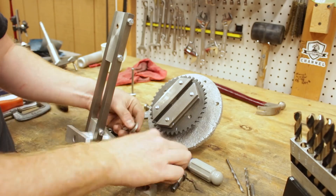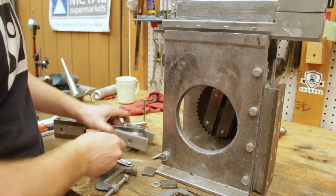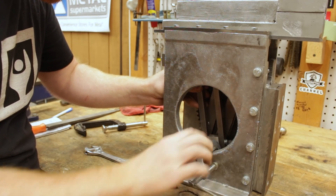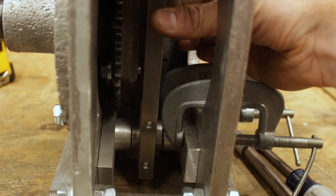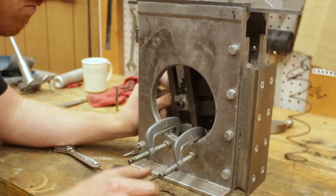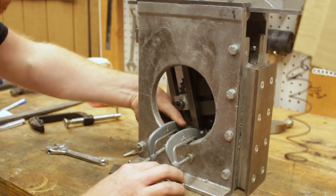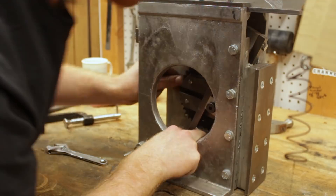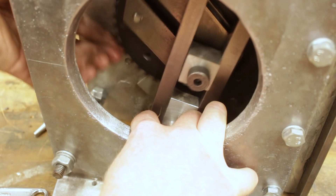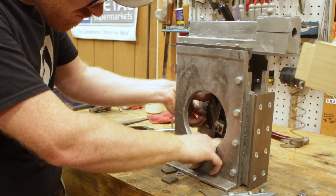The book describes a kind of iterative approach to positioning the yoke inside the column. Basically I clamped the boss on the left side of the column and finely adjusted where that pivot point was located, so the clearance on the front would allow it to just barely clear the front casting, and the clearance on the back would prevent it from hitting the brace on the rear of the column. It involves changing two things: the position of the pivot and the location on the bull wheel where the crank pin is located to drive the sliding block that rides inside the yoke.